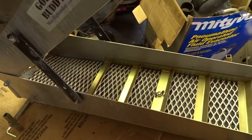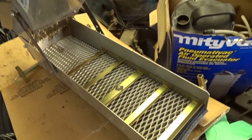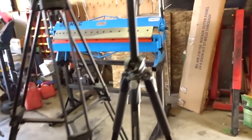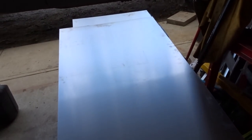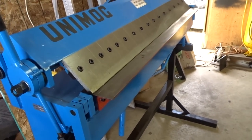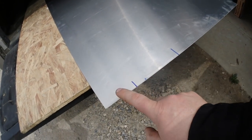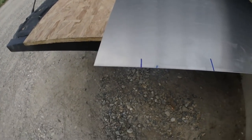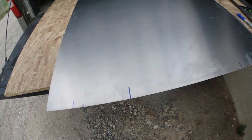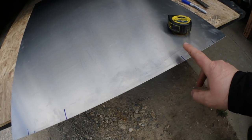The problem is this one was buried over the wintertime and I thought 16 gauge — which this is — would be too thick, so I bought 18 gauge. Now comparing them, the 18 gauge is quite a bit thinner and it's going to be a lot flimsier, which means I'm gonna have to do a double lip on my sluice box to get some strength. I'll start by getting the main piece bent. This fold line is going to be bent over — that's five inches running along the top — and when pulled over it'll make the sides stronger, but there'll still be flexing issues at that point.